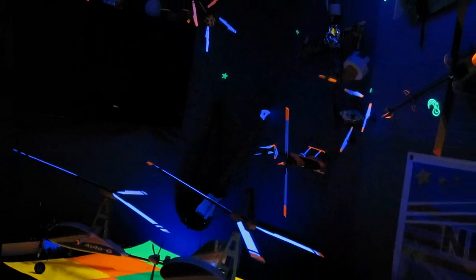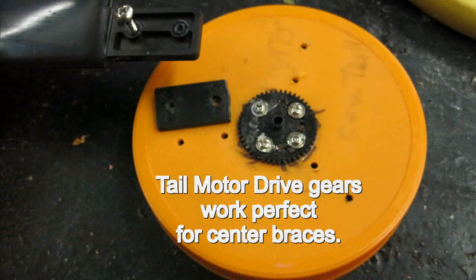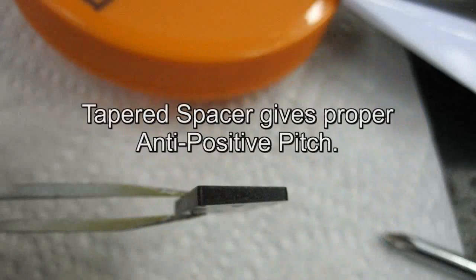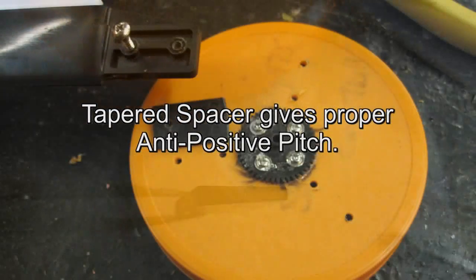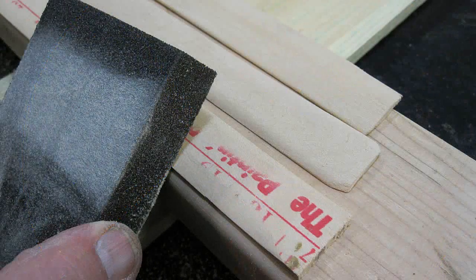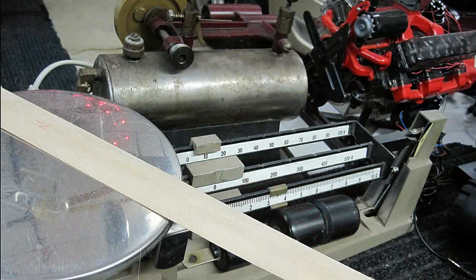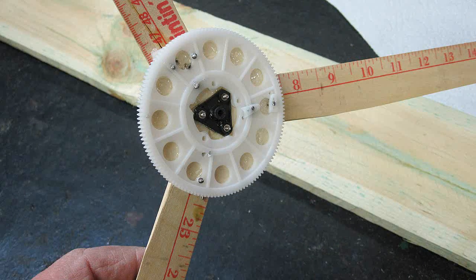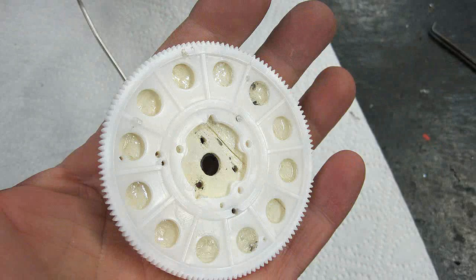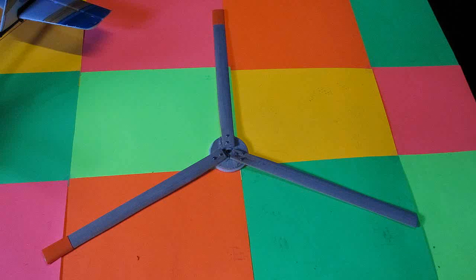After breaking the blade holder, the spare blade holder, and blades in heavy winds up here, I decided to go ahead and make my own blades and blade holders. I did this while waiting for back-ordered parts. The strongest way I found to make blades was to use ACE Hardware wood yardsticks. I shaved and sanded them to be as close to a simple Clark Y airfoil as possible, though they actually wound up more like the night flyer YY profile.